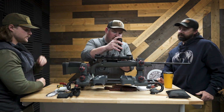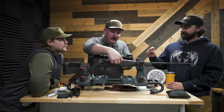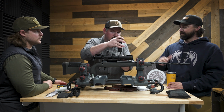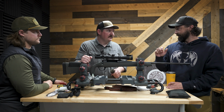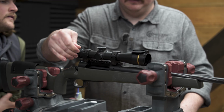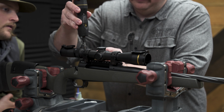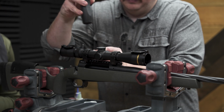A couple things, from doing it wrong different ways over the years, to pay attention to during this step: as you're doing it, check to make sure one side's not compressed more than the other. Second thing is, we kind of take care of it for you with the J-rail, but at the back, make sure your scope zoom ring is not touching anything. Sometimes in your setup process you may have moved it too far forward, or it may have been sitting on the last tooth, and you don't notice it until you tighten your rings down, and then you can't move your zoom ring, and you could actually do some damage. Depending on the shape of it, it will be clear in one position, but then you rotate and it's going to bind on whatever lever or something. Another fun thing. And so I just do a star pattern here, and I'm making sure they're both even.